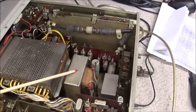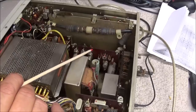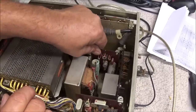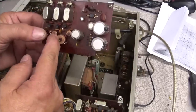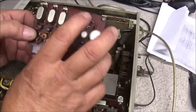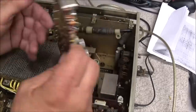Inside the radio you'll note the transformer here, and here's another board — our regulator board and our beat frequency oscillator board, all on the same board. Kind of strange that they'd put the beat frequency oscillator on the same board as the power supply circuitry, but they do. When we pull this board out, you can see this half is our BFO and this half is our regulator, bridge rectifier, and filtering for the two power supply rails. Turn it over and you can see it's separated right down the middle by two ground plane traces — simple but effective.